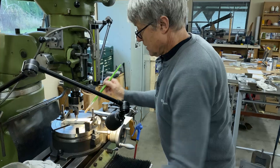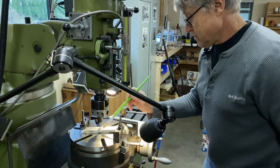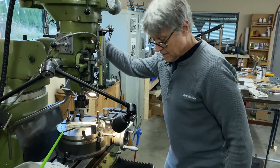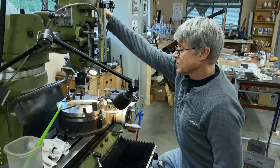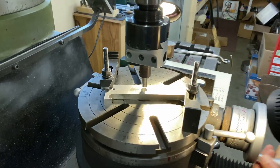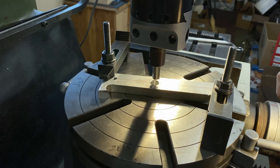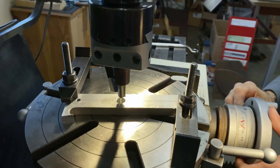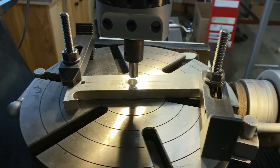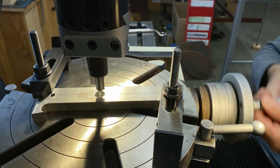Putting some cutting oil down there. On this operation there's no noise really, no sparks. It's not exciting like watching a chopper being built. Here's a cut — that's one cut. Now I turn it. I'm going 11 degrees and 37 minutes. There's my 37 — so that's my second cut. Now it's 23 degrees and 14 minutes. I keep on going like that.